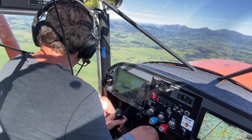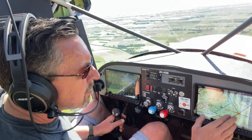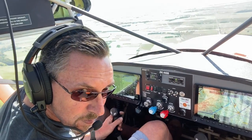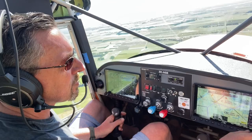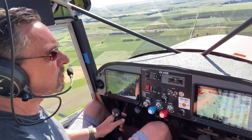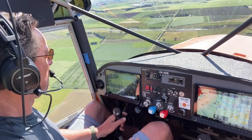Quite early on, after two or three hours, I took the aircraft up to a safe altitude and did some stalls — preliminary stalls, just to get my hand back in and satisfy myself that the approach speeds I was flying were sufficient. I did two sessions with the aircraft lightly loaded, pretty much on the forward CG limit. All of them went okay, though I managed to drop the wing twice, so I will go back and have another look at that. I'm going to do a whole bunch more stalls at various weights and various CG areas.